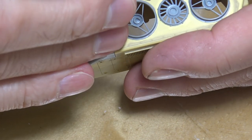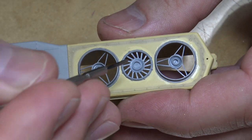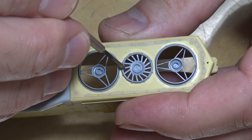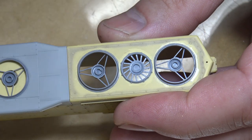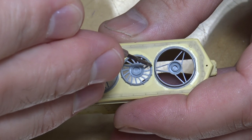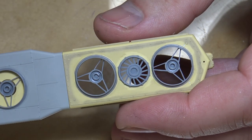All right, so these are the mounting bolts right here. 1, 2, 3, 4, 5, 6, 7, 8. 8 mounting bolts. You notice how the center line here, they're evenly spaced across the center line? Well, do not put this little detail right here on the center line. It needs to straddle the center line evenly also. What that detail is, is the strap that holds down the grill. So you got the bolts, then the strap, then bolt, bolt, strap, bolt, bolt, strap, bolt, bolt, strap. So that's the orientation of this 36 inch cap top fan base.